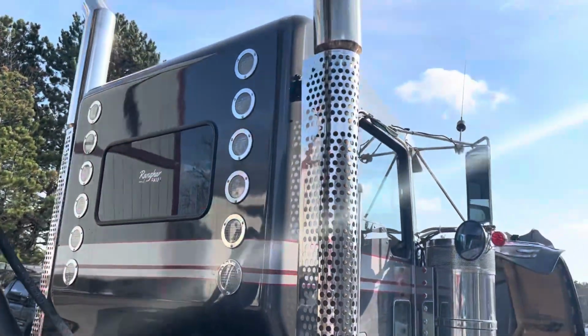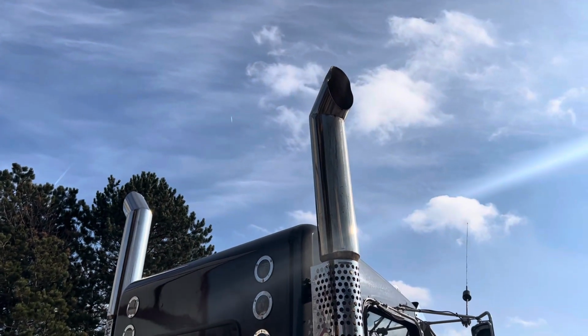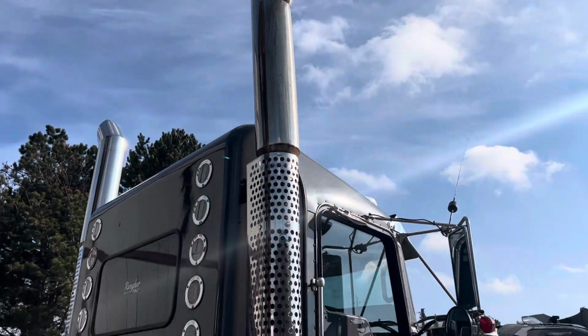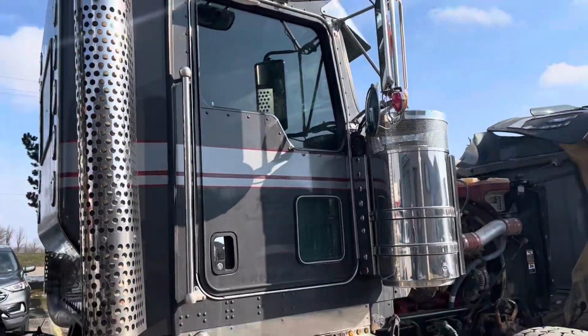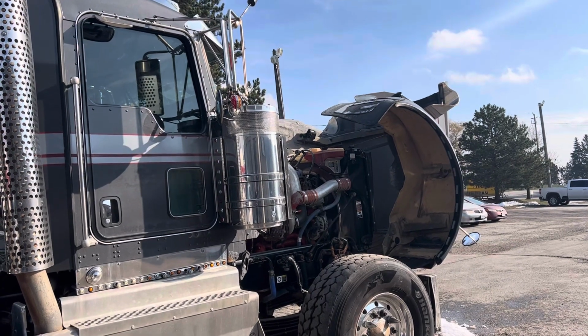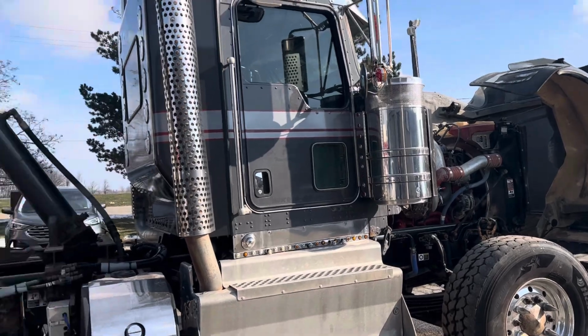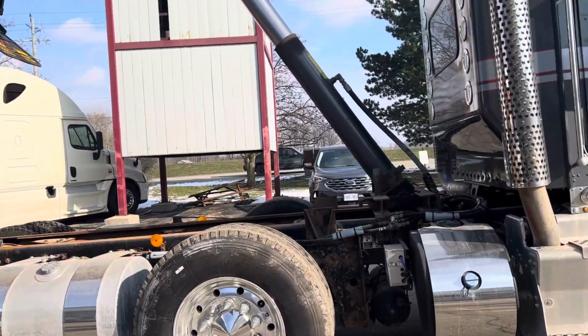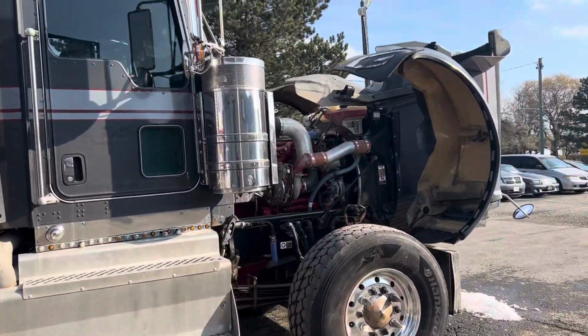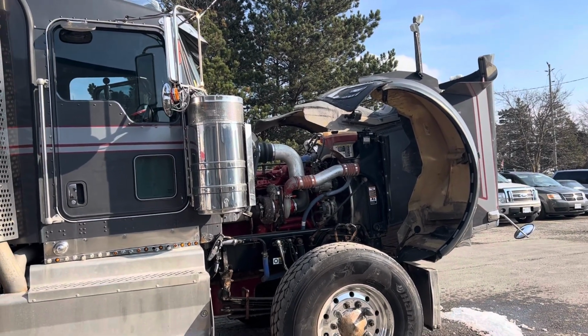Cab. Important part when you're looking at stacks on a DPF truck is that there's no black. Otherwise, we've got some issues. So I'm going to go under the hood. I'm going to take the oil filler cap off. Get a good look at the blow by that's going on this thing. And then I'll put that axle down and we'll get the airbags up. We'll see what all that good stuff does. It's going to be hard to hear me, so I just want to just run the video and let you have a look at the blow by.